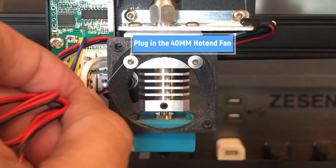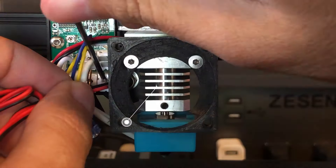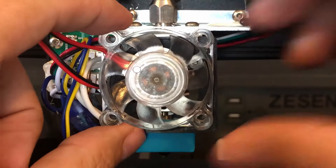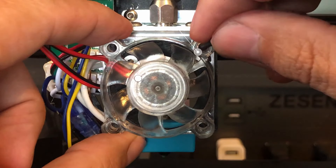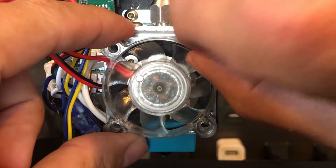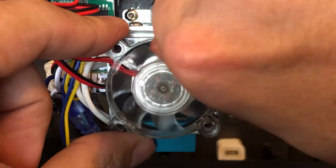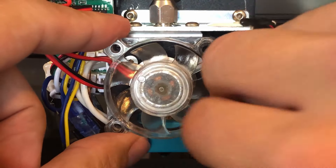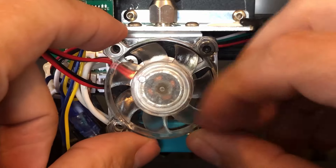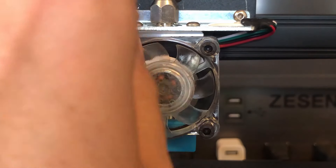It would have been easier to plug this in before the fan shroud, but if you're an idiot like me, you can use an Allen wrench to push in the connector for the 40mm fan. Pre-tap the holes with the screws — do it to all four, including these four M3x12 screws. It will save you a lot of pain and agony. You'll still see me fidgeting because this part was printed with polycarbonate carbon fiber, which really doesn't like to be threaded. Enjoy the knuckle work — eventually we'll get to screwing it all together.